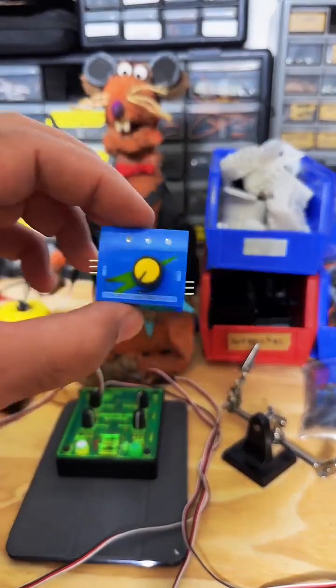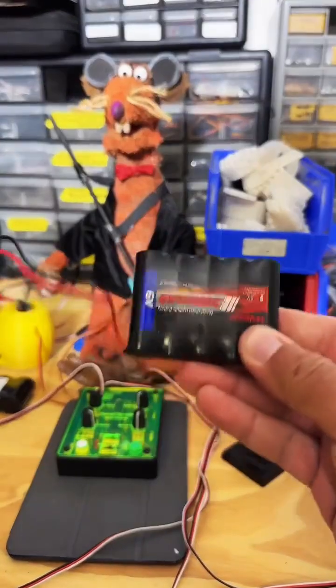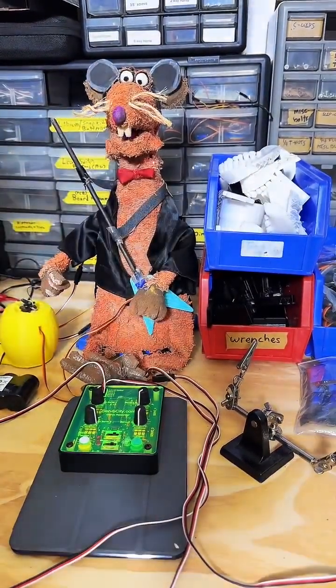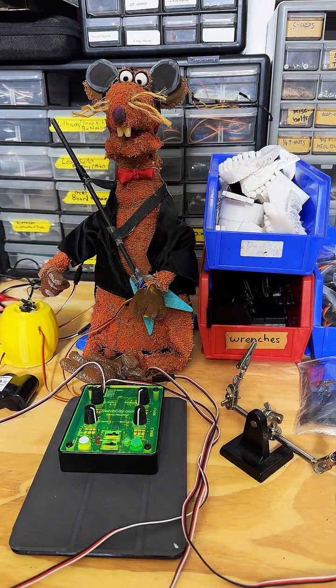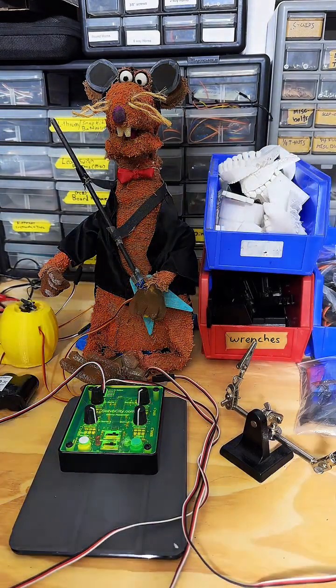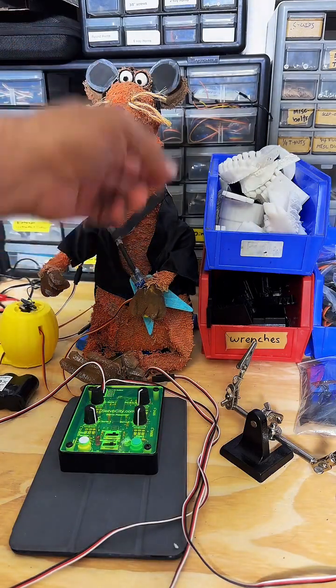And you plug it in with a 6-volt battery pack to this little tester here. That's in the kit, right, with the battery pack. You're going to use that really to move one thing at a time, because you're really not going to want to move 3 servos simultaneously, particularly in a puppet, right? You don't want this guy's mouth, his head and his neck all moving, right?